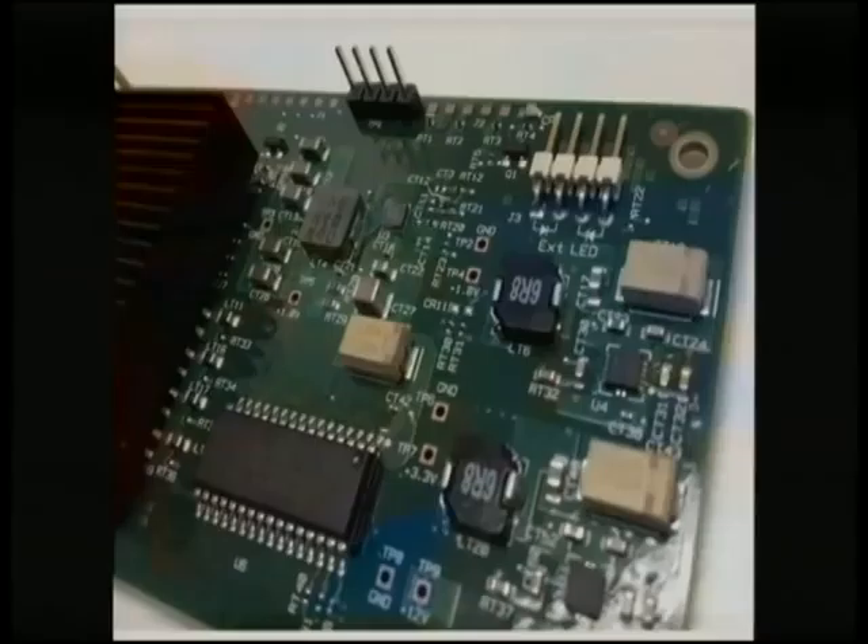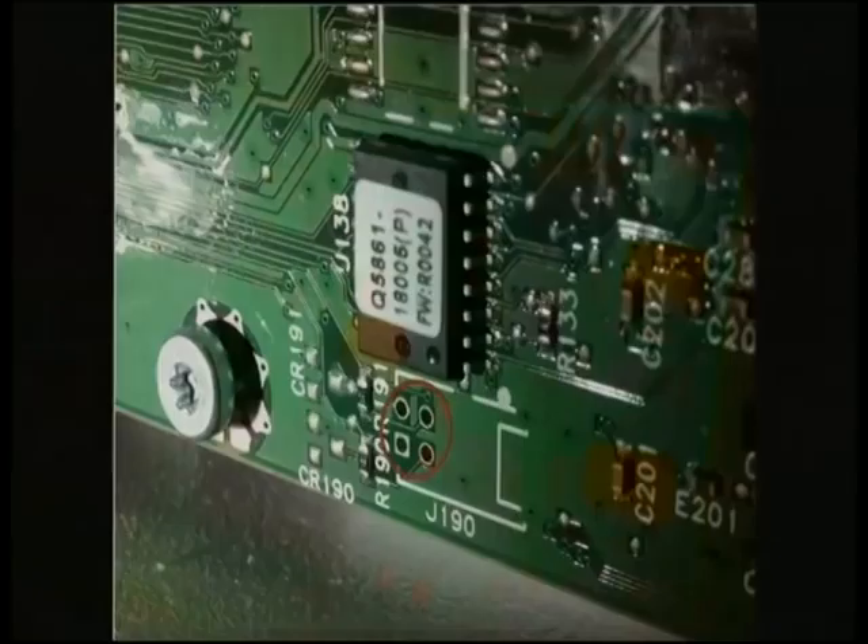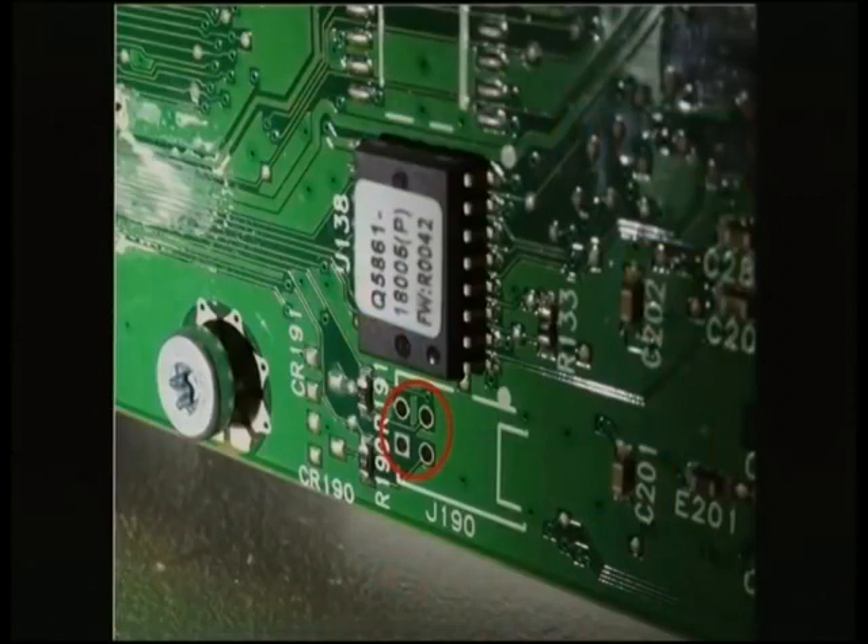These serial test ports are everywhere - my CD player has one, I've found them on LCD monitors, set-top boxes, and a PCI SAS card with an ARM microcontroller. A printer someone brought into work: five minutes with the lid off, I found a port with two resistors mounted next to unpopulated pads. Resistors cost money, so no one puts them there if genuinely unused - it's a test port. Three or four pins: ground, send, receive, sometimes power. Connecting a serial cable to this printer revealed it was running VXworks with a debug shell and all sorts of flags you can tweak.